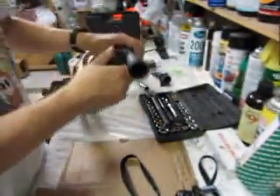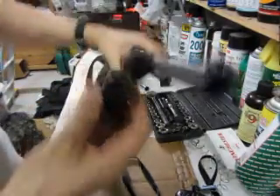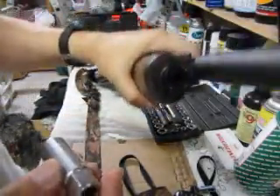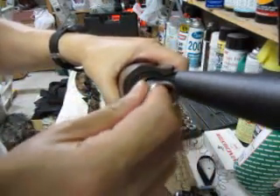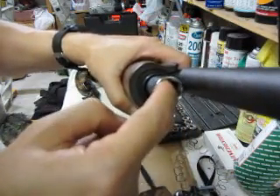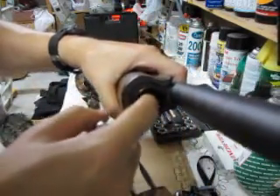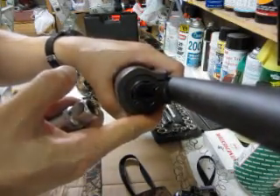I haven't tried it out yet, but you'll find out by the end of the video. First things first, you've got to take the original cap off. And then with the newer 870s, from what I was told — it's not on the older 870s — but inside the magazine well, there's two little nubs. You can see my socket doesn't go in all the way, so I'm going to use this socket to knock out the two dimples. Let me stop the video and take a picture of that, and then we'll continue on.